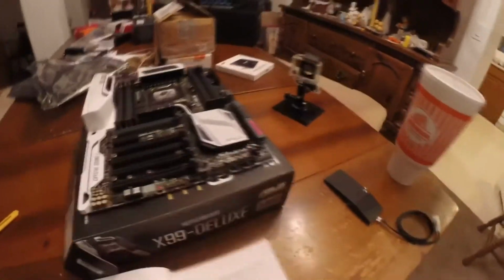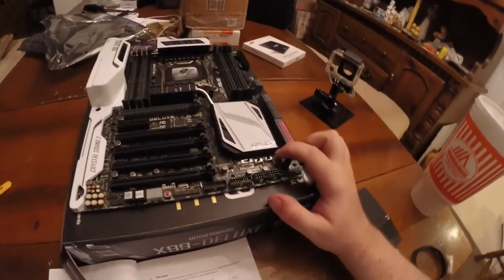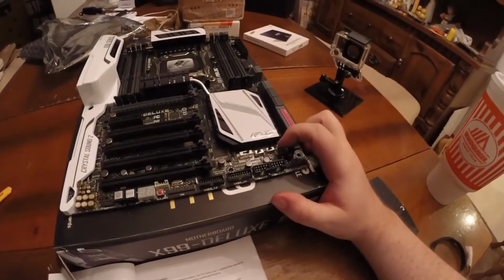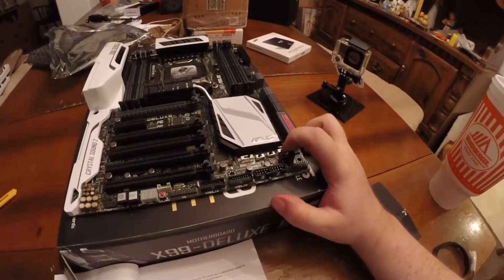So, TPU, okay, yeah. In the initial position, which is all the way on this one, the TPU switch over here. So, I'll flip this around. So, the TPU switch, get my hand out of the way. This one has a friggin' wide angle of view on it. So TPU, that's this switch here. All the way over it's disabled. This enables CPU ratio boost, and then this allows CPU BCLK and ratio boost.